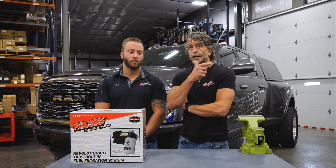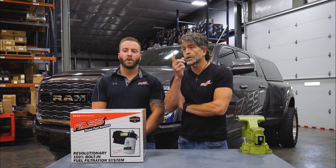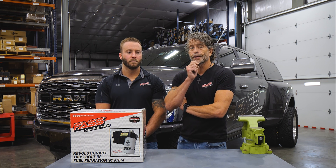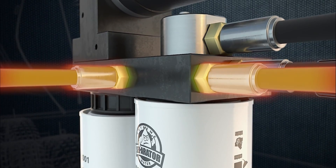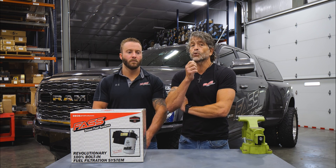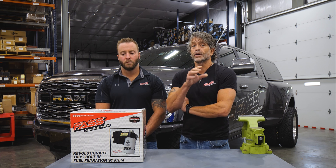That's what I did on my Duramax when I had it — it does an excellent job. On my Duramax, it was not starting; I had all kinds of fuel pressure, but the cascade valve wasn't opening at the appropriate temperature. I finally got it started and went back — that's why I doubled up on the heaters. It put enough heat up the line to actually open up the cascade valve. We did that multiple times to confirm that was the fix, and it was. So that's why I'd let it heat up like that — you'll love it.